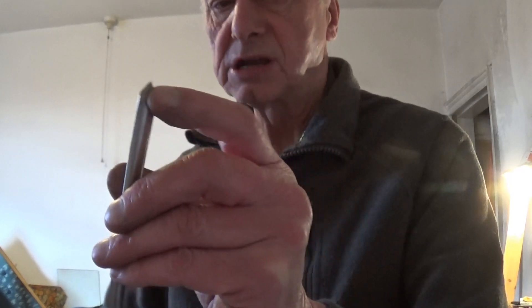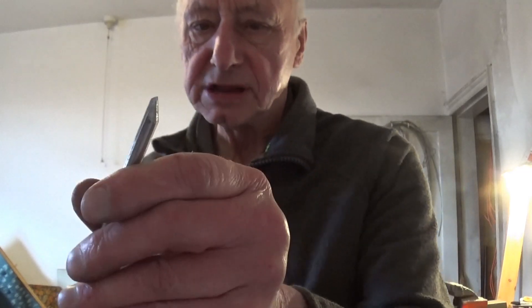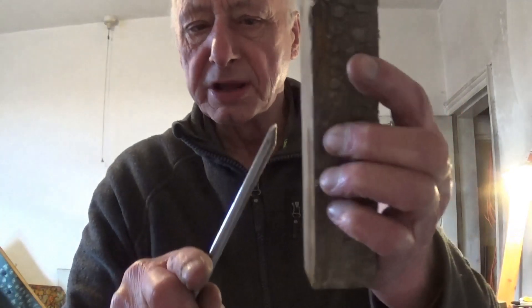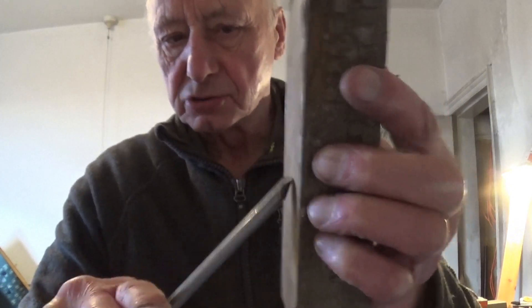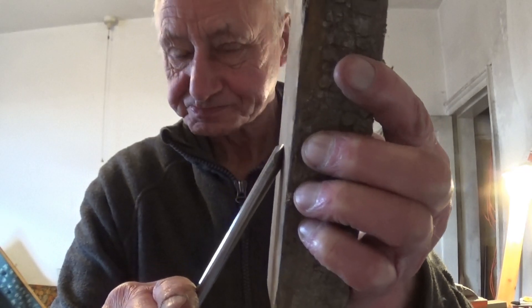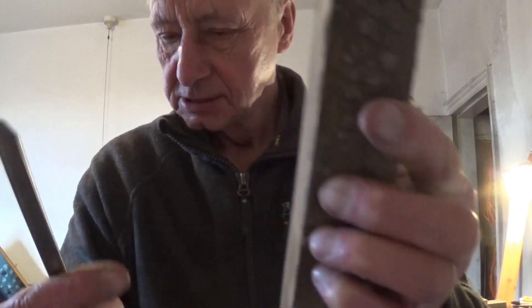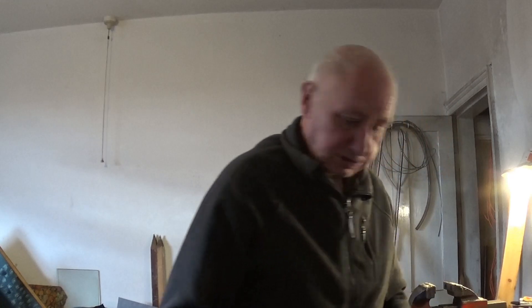Because what you have to do is put it on like a plane. Let me get a bit of wood to show you. What you have to do — you have to hold it like that, so it doesn't dig in, you're like planing it. But with this one, the second that I got the edge anywhere near, it dug in. So it's no good. Last time I used these scrapers I struggled. I'll put a video up with a bit of a clip, because this is short.